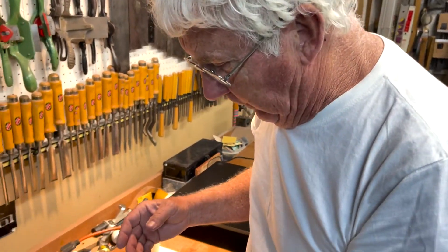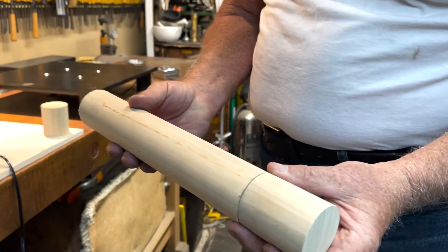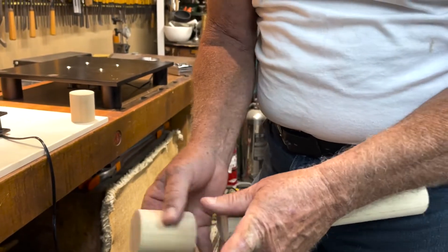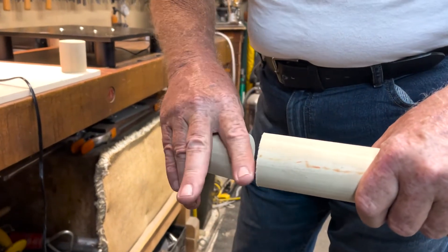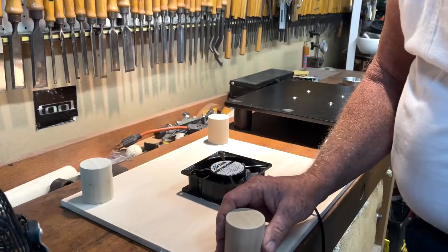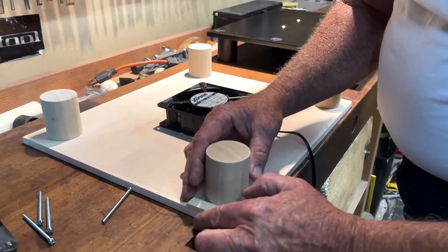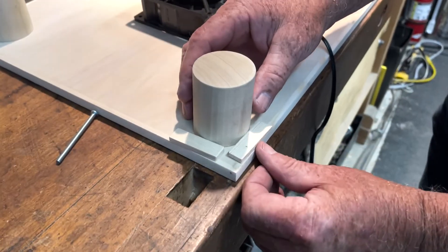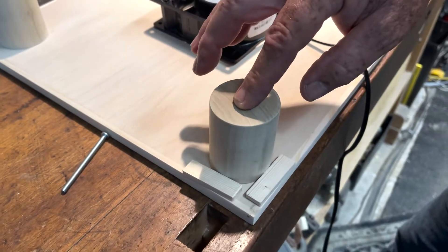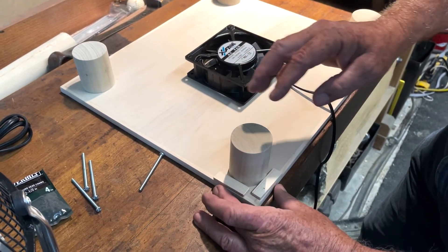The feet come from a three-foot-long dowel. I just took two-and-a-half-inch increments and cut them on my table saw by putting a piece of tape on the fence to mark the distance from the blade and kept knocking them out. These little cut pieces are good spacers — basically half-inch gap spacers of wood. All you have to do is glue them right down.